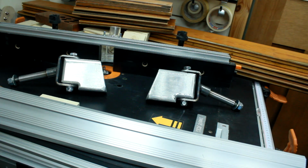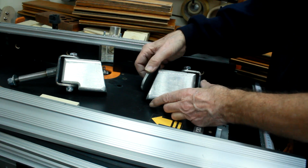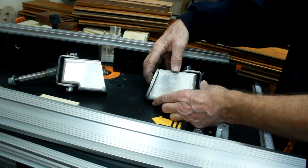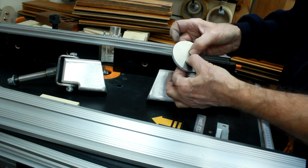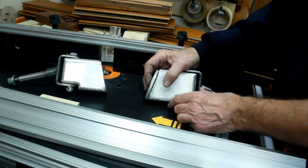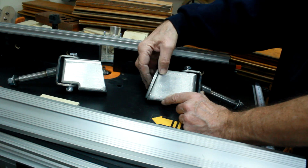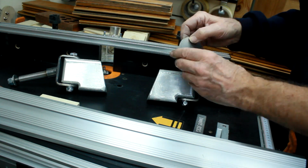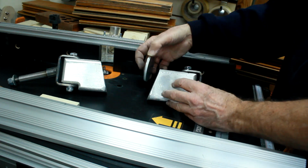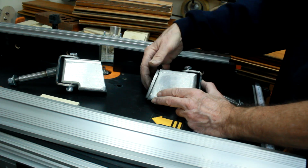Before I get too involved in getting them fancy, they need these plates bolting to them now. So I'm going to drill the holes for bolts in the plates, drill and tap these. I said originally I think I was going to do M6, but I think M8 would be better, to give it a good solid fixing. And then these will of course have to have machine screws put all the way through them, countersunk, so that they'll be sticking out to receive the end of the axle.